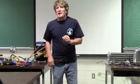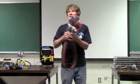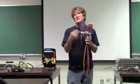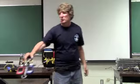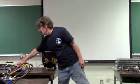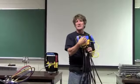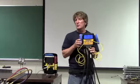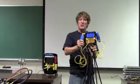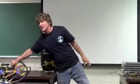When you get started, what you're going to want to do is get the right gauges. I recommend a digital set of gauges. Okay, this is a really nice set that allows you to not have batteries because they're solar powered. The better ones are something like this that allow you to get digital outputs. It actually converts pressure to temperature internally for those refrigerants, and has clamp-ons that clamp onto the line sets, so you can measure the temperature, superheat, subcooling, all that kind of fun stuff. So, we're ready to get started.